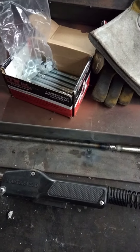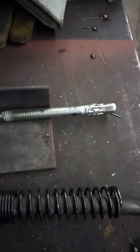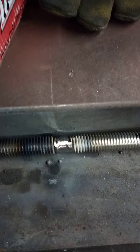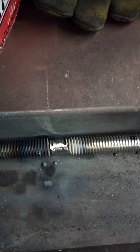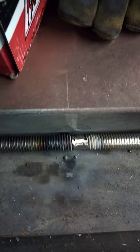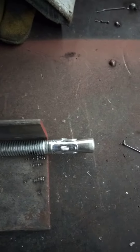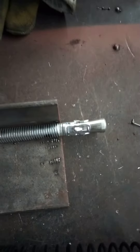I thought about it for a minute and was like, piss on it. I just kept the five and a half inch bolts that I had, went and got some grade 8 all-thread. Left the end to start the nut on hanging over the angle in case it arced down there so I can still get a nut on. I just cut the length that I needed - they're about 17 inches overall - just welded the things on. Ground it down a little bit so the weld's a little smaller than the threads, that way it'll slip through the hole no problem. Still has a regular concrete bell on it so it's still going to grab the concrete like it's supposed to.